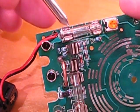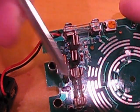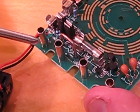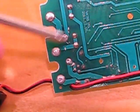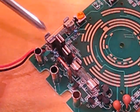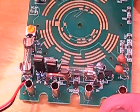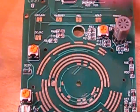The fuses are glass fuses, which are less expensive than ceramic fuses. If heavily stressed, glass fuses have a habit of actually exploding. If you're doing mains electrical or electrician work, this is probably not the meter for you — but for electronics work it'll be just fine. The input jack solder joints will want to fracture eventually, but you can touch them up with solder when they do. There's a precision loop of wire for the high current mode, and terminals for the thermal sensor. There are also some thermal resistors, so this thing can survive some degree of overload — that's pretty promising. The adjustment pots up here don't appear to have any lacquer on them to hold them in position — if those wander, your meter becomes inaccurate.